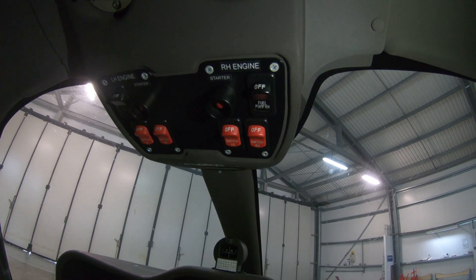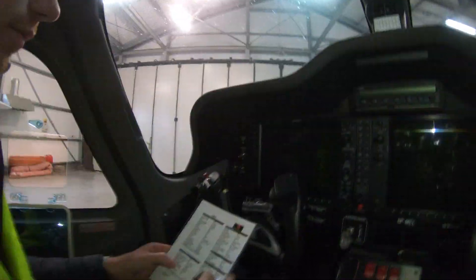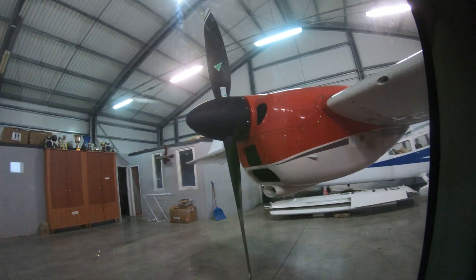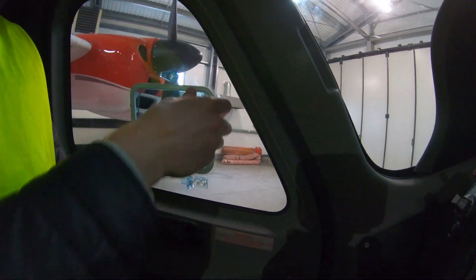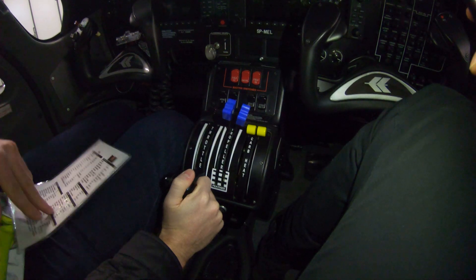Then you go clear. So here's your starter — it's got a little safety guard on it. When you start the engine there are a few things you need to do. First of all, check that the propeller area is clear. Make sure that there's nobody around it, then give a good shout — 'clear prop' — using the little window over here to shout out. Then you hit the starter button. Once you press the starter button, the engine starter will engage and it will start to turn over.